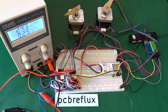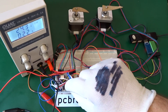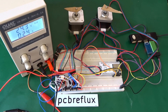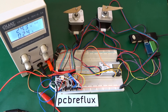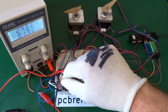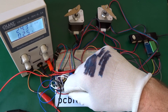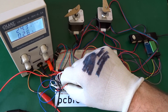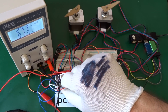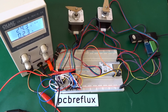I can show the difference between 32x microstepping and full-step by changing the mode wires from 3.3V to ground or vice versa. You can see the stepper motors are now rotating very fast. It depends on your use case — if you want precise, slow speed and high torque, use microstepping; if you need very fast motion and don't care about precision, full-step is fine, even if you lose some steps.